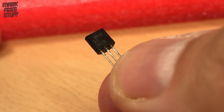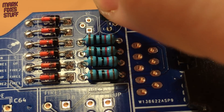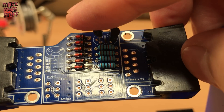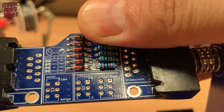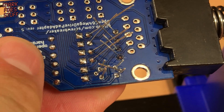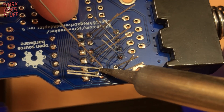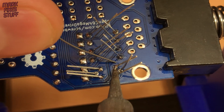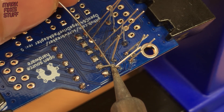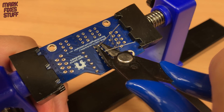Next are the very common BC547B transistors. As long as you make sure the shape of the component matches the board's silkscreen, the collector, base and emitter legs will be in the right places. Getting the third leg to slide in can be a bit tricky, so make sure it's properly in the hole before you push. On this board, square pads are connected to the ground plane, which is the largest metal layer — it absorbs heat quickly and can make those joints harder to solder, so just keep at it. Then clip the legs like hacking away at an overgrown bush.